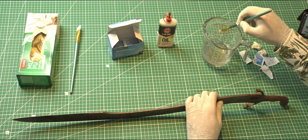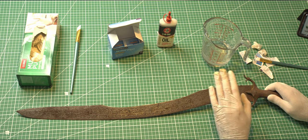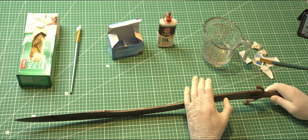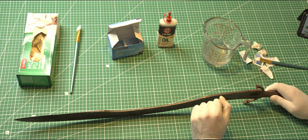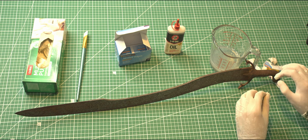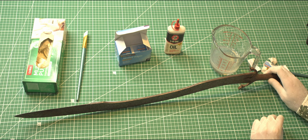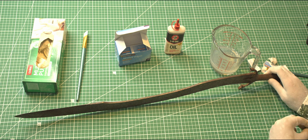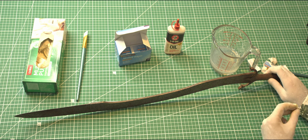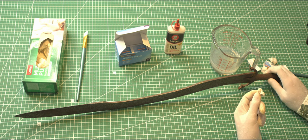There is a tiny bit of runover onto the sides of the sword — that's not a concern because we plan to restore this entire sword. So I'm going to see if this works and I'll be back in just a moment. We've waited for a little while, and now I'm just going to wipe off the gel and see if there's been any change. It would appear that we haven't yet had a visible change, but we also haven't damaged the blade in any way. I expect this is going to take a while because it is using chelation. But if I look at the gel, it has actually taken on a red colour — so I know that some action is occurring.